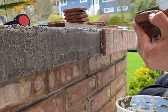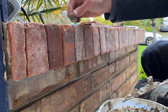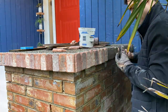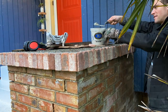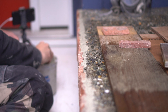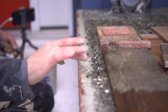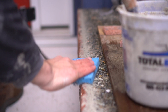I also plan to resurface the top portion of this concrete slab because the exposed aggregate just does not look great. Let me know in the comments what you'd like to see on the top portion — I actually have enough brick to do a herringbone pattern up there. After applying all the bricks to the edge, I come back around with mortar mix to fill in all the small gaps to ensure no moisture can get through. Then I wipe off the edges with a sponge and we are done.